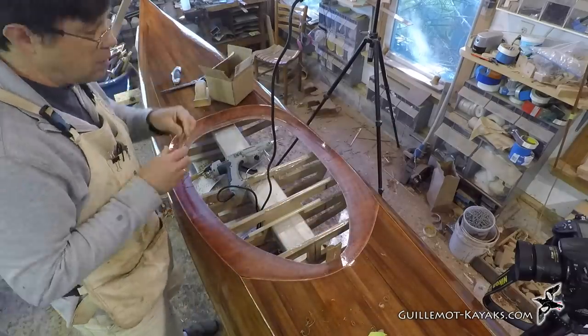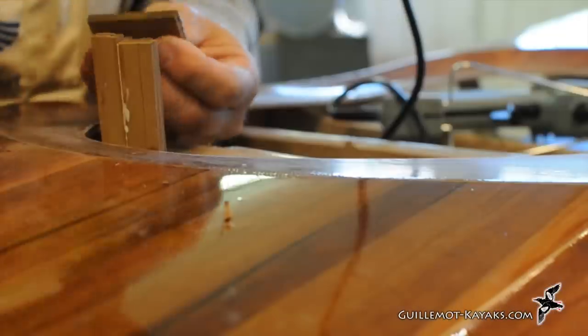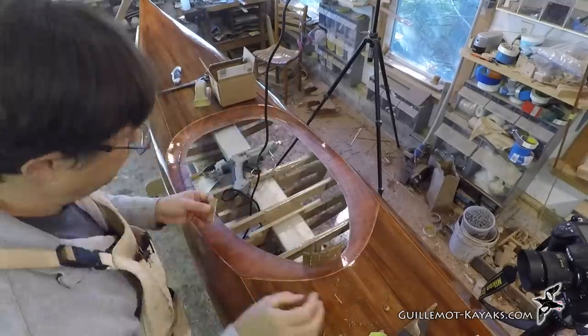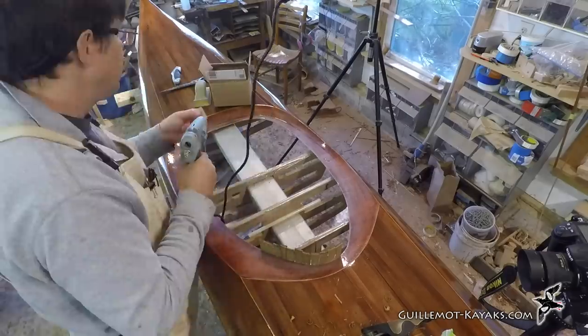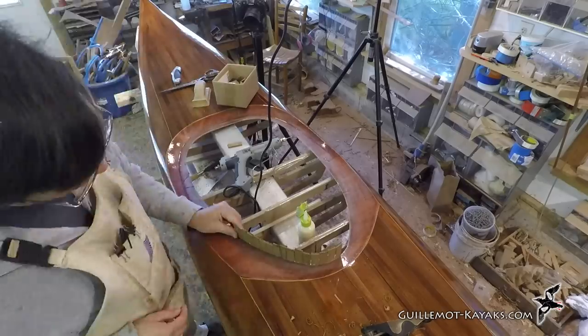The rest of the combing is mostly the same: check the fit, bevel as needed, yellow glue between the strips and hot melt to the boat. While this system seems like a slow, tedious ordeal, it has the advantage of using material you already have and you don't need a separate building form since it's constructed in place. Compared to making a combing form, cutting veneers and gluing them into a lamination, this method is quick and efficient.